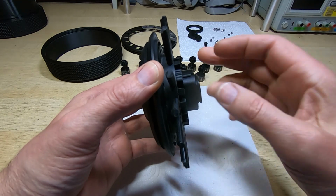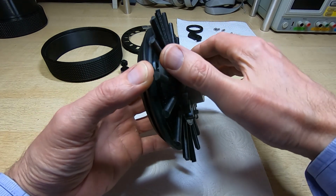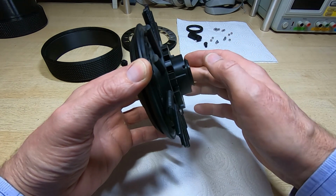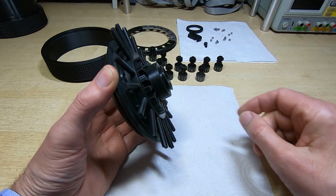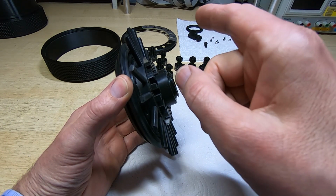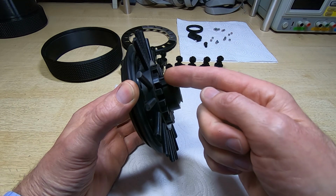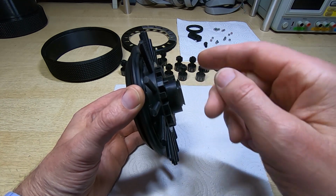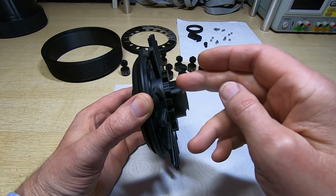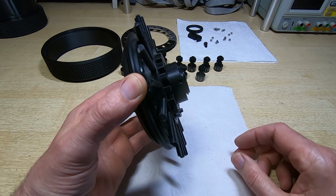So it's now got the detent plunger and spring in, and as you can see, it comes out of the detents quite nicely, spins very freely, almost no resistance whatsoever, and then it pops into the next detent quite nicely. So the changes I've made to get it to do this is I reprofiled the little valleys that the pin sits in, and the top's now very slightly rounded, but also the lower section has a bit more of a curve to it. I decreased the length of the pin slightly and increased its end radius, so it doesn't sit quite as low in those valleys. And I shortened the spring by another millimetre, so it's not quite as firm, and now it comes out of those valleys and spins very freely.